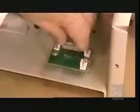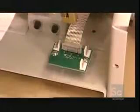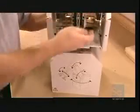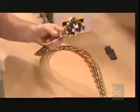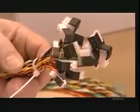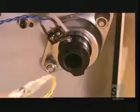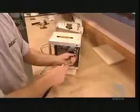They plug an electrical wire that links the gripper to the shoulder into a circuit board located in the shoulder. Then they screw the entire arm to the base. They link up the wires from the circuit board in the base to the motors in the shoulder. To do this, they have to bunch the wires, 48 of them in total, and thread them through the shaft that attaches the base to the arm.